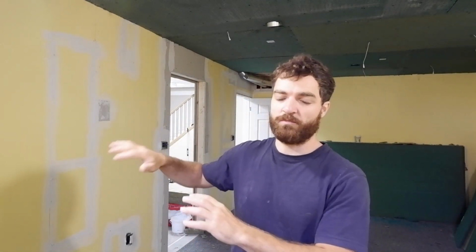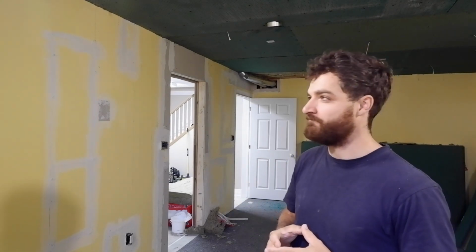In today's video, we'll probably be installing the Sonopan on this wall. Once it's installed, we can put our resilient channeling on and prepare for drywall. So we're doing Sonopan, resilient channeling, two layers of 5/8 drywall, all in attempts to create more of a sound resistant room. No company likes to say soundproof anything. So sound resistant, as good as we can, because these rooms will be converted into clinical rooms, and to avoid any exterior sounds coming in and interrupting the workspace, we're going to try and eliminate that.